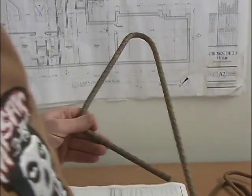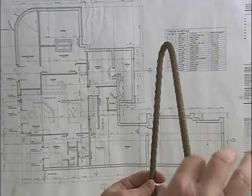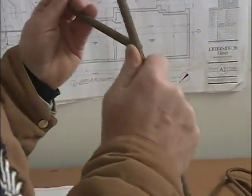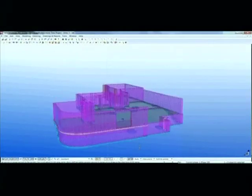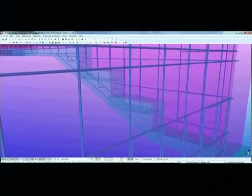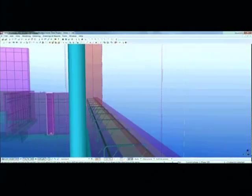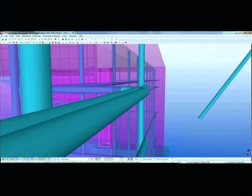This little piece here is called a stirrup — it's all pre-bent. This goes into the brick or stone ledge; you just slide it in, wire it up to the rebar running through the ICF, and they're all set for the pour. It's also nice that they can do a computer 3D model of the house, modeling the rebar placement before you actually start construction. Of course, this is all based on what our engineer is recommending.